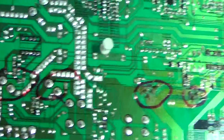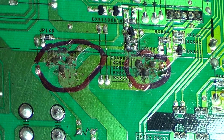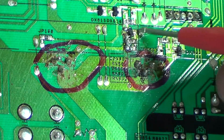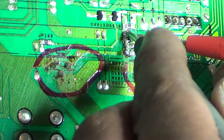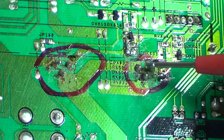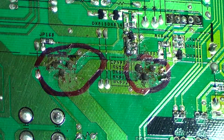Also check your resistors — make sure they're not burnt. This particular board looks like it was worked on before. You can see a little transistor here and a FET that checks short, but that's probably because these two MOSFETs are shorted. We're going to remove them one at a time and check.